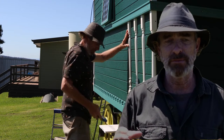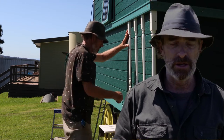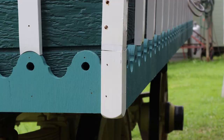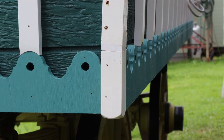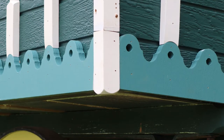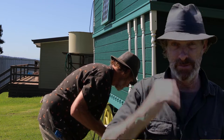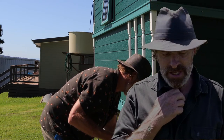So I went and grabbed the very short balustrades that I couldn't use, chopped them off, utilized the little curved section at the bottom, and you'll see by the pictures, and I screwed those two points on at the back there, and then took the corner ones after having flipped them and butted them on top of that. And so that's going to require some filling, patching, filling, sanding, painting, all of that kind of thing to make it look like one. But then I'll put some masking tape in line with the top of the bottom horizontal trim and paint the lower portion the same as the trim, and the top will remain white. So that sort of fixed that problem.